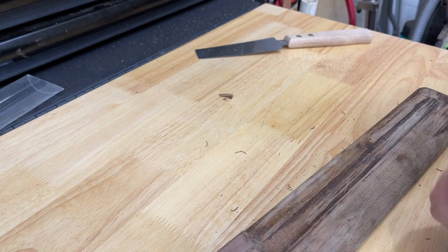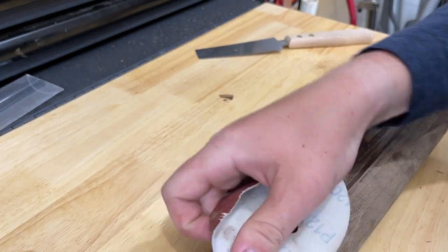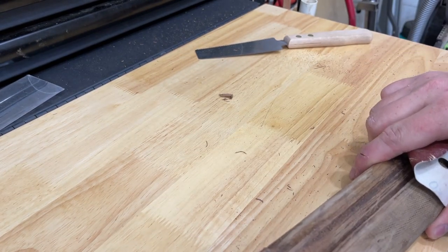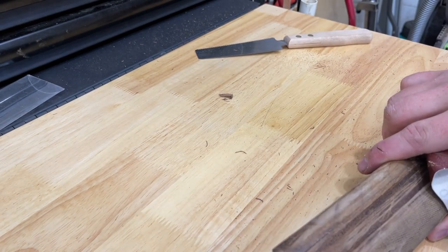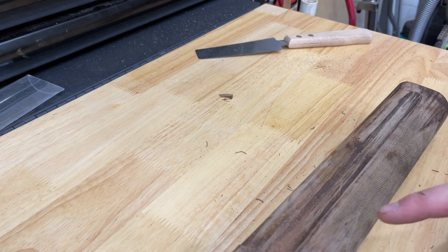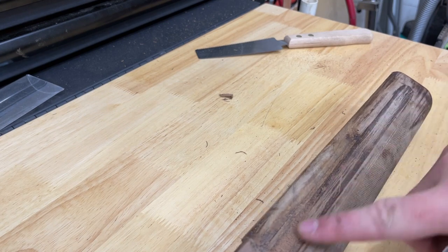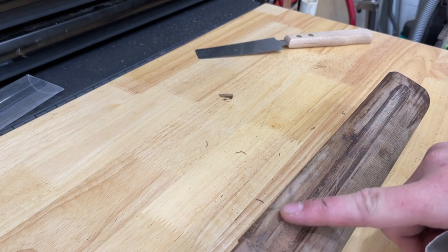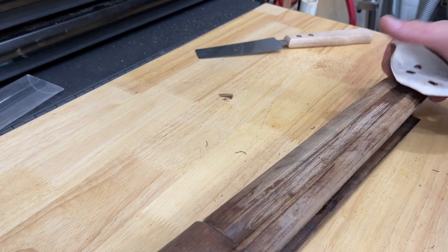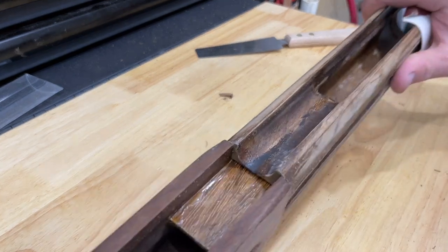Start rough, 120 grit, and walk our way down my pile of sandpaper. So, yeah. I'll probably have to break the Dremel out to blend these two inlets together, and try to get some of this ridge down faster, although it's always bad to take too much material. It's better to go slow.